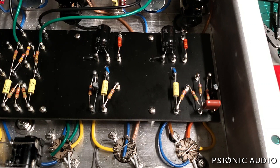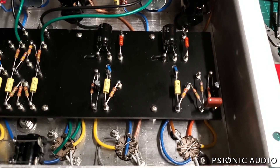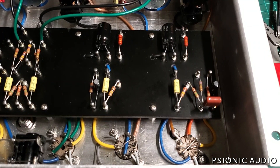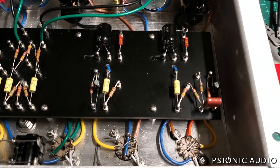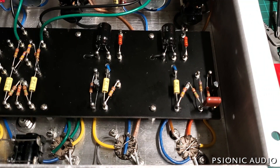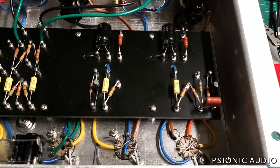With the Tungsram in, I had everything set up so I had 112 volts on the plate and 75 volts on the screen — that was pretty much the sweet spot I wanted. So 112 and 75. Now I've put in this Electroharmonix and I'm at like 170 volts on the plate and 85 on the screen. I've got a fixed voltage divider that roughly sets the screen within a certain range, but it is still affected by the plate.